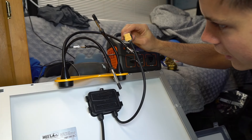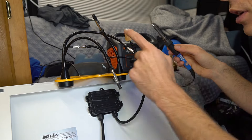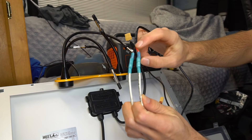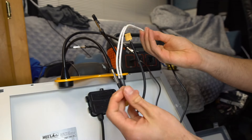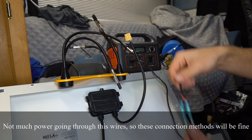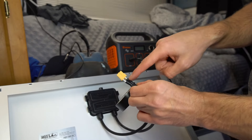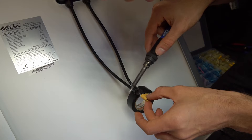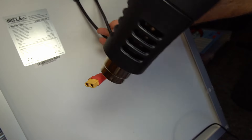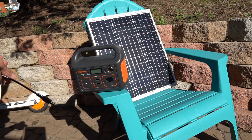Just solder it right there — make sure it gets nice and shiny, which means the solder flowed through the whole joint. If you're not doing this yourself, you can buy XT60 connectors with crimp-on adapters. By the way, this is what the Jackery cables look like: a black and a red, crimped to my XT60 connector. These are different-sized wires, so you'd need to remove a couple of strands to fit the proper connector, or fold them in half and push them in. I'll use electrical tape to hold it steady while soldering, let it get nice and hot, let the solder flow, then add heat shrink to protect the joint. That's what it should look like when done — really nice and clean.